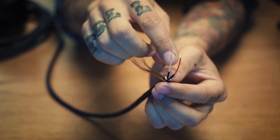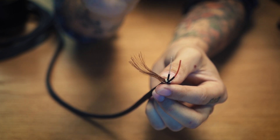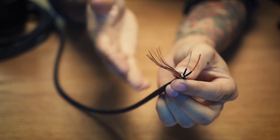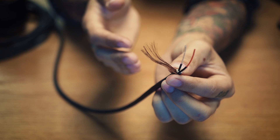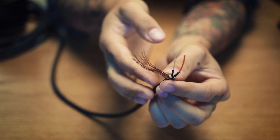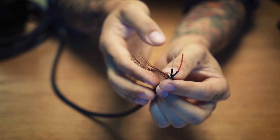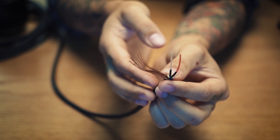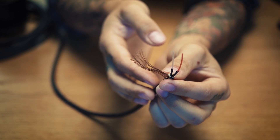Since the cable picks up noise along its path, it picks up noise in both signal cables. But because the signals are going out of phase with each other, when they arrive at the other end and the phase is flipped back, the noise cancels out and we're only left with clean signal. An unbalanced cable only has one signal cable and one shield, so it picks up noise and only the shield offers protection — which works a little bit, but not as effectively as totally cancelling out all the noise.